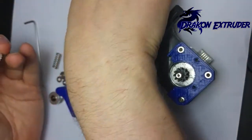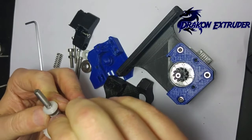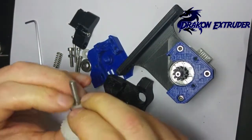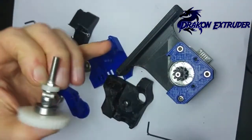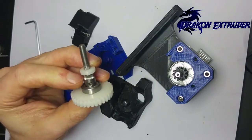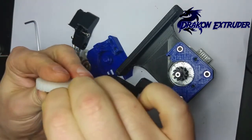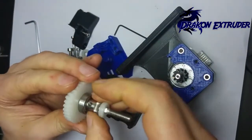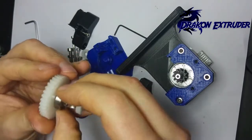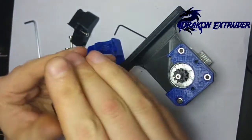Once it's past the thread it will push down. Make sure there is no slop in that gear — and if there is slop in the bearing, tighten the grub screw. You want it tight and down, but you should still be able to move the bearing. Once correctly tightened, there should be no slop in that bearing at all.